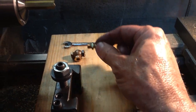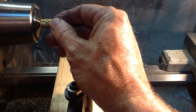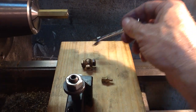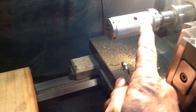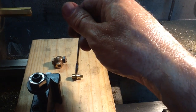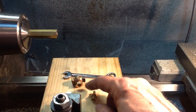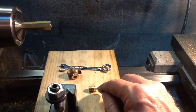I flipped it around and used a 5/16ths round collet. I replaced the hex collet, used the 5/16ths round collet, and I didn't tighten it — I didn't want to mess up my nice threads. I just snugged it gently in the collet, and when I was using the tailstock die holder to cut these threads, I just held the hex with this 3/8ths inch ignition wrench. That held it steady while manually threading the threaded portion on. This is a number 10-40 thread on the outside.